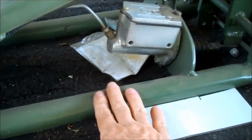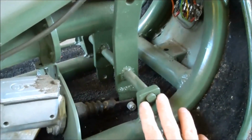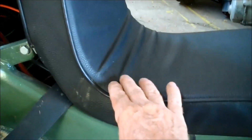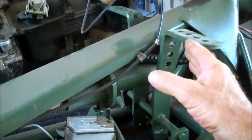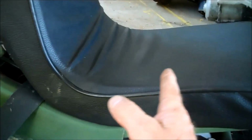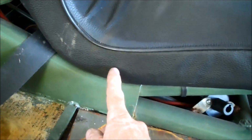So we put the bottom rails together, and then put the pedals on. That's the second part you build, the pedals. And then you've already built the seats, so you foam the seat up so it has the proper amount of foam, so that when you sit down on it, you're in the right place. Then you put a 2x4 here, and this is all in the other videos. You put a 2x4 here, set the seat on it, the driver sits here, and you position yourself so that you're the correct distance away from the pedals, so that when your driver sits there, everything is in the right place. Once you get that set, then you mark it. That's where this bend goes, right underneath the butt of the seat.